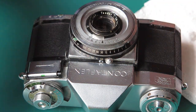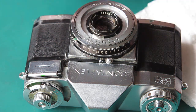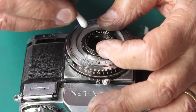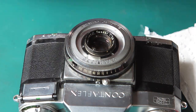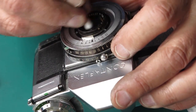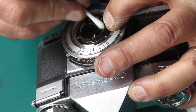That's in there. I haven't lubricated it yet, and I'm not going to remove it to lubricate it. I'm just going to back it out most of the way, put a few spots of helical grease around the outside, and then screw it back in. I'm not going to fight for that more than I have to. But the glass surface needs to be cleaned. This is the most obvious glass surface on the camera.